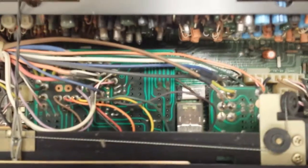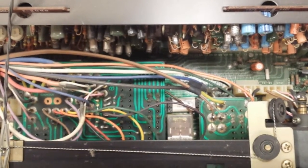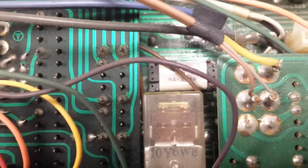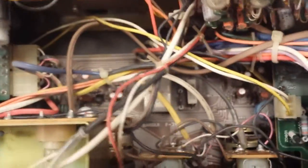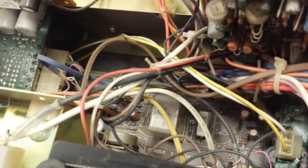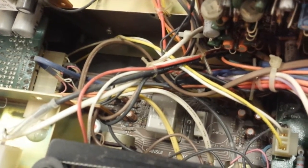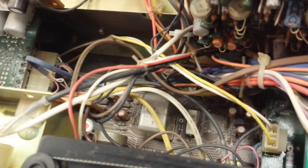Down here, what we're looking at is the four-channel selector board. There are two relays here below. This Hitachi relay — people say it goes bad, but I've never really seen an instance where that's happened. Same with the relay that goes between CD4 and matrix mode. There's also another switching relay which is part of a phase inverter circuit when you go from four-channel mode to two-channel mode to two-channel bridged mode. This can go bad if you're in an area with a lot of saltwater corrosion, but it's a rarity. Last one I saw was maybe eight years ago, and it was literally about a block from the ocean.